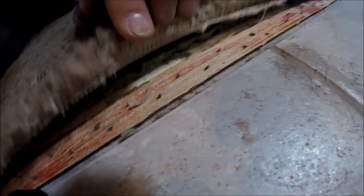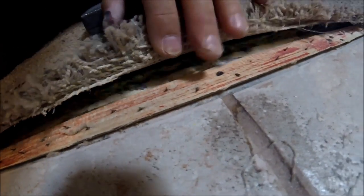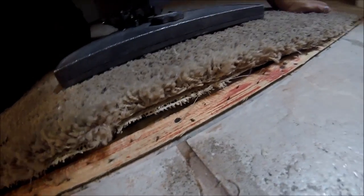So what I'm going to do — I'm going to get it stretched up far enough here, and I'm going to take my PAM gun and I'm going to adhere the backing and the carpet. Once I get it stretched up far enough, I'm going to glue that to the tack strip. That's going to bond the backing to the tack strip so we're not ever going to have to worry about it coming loose again.